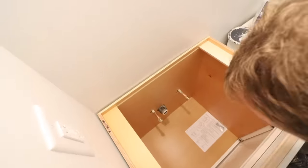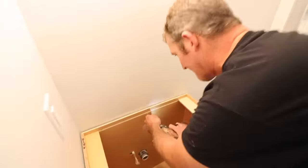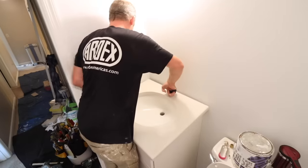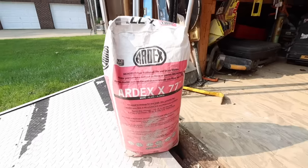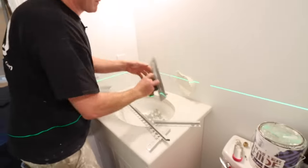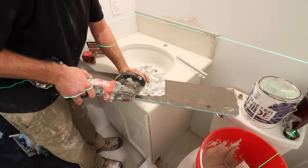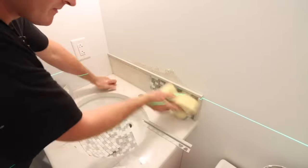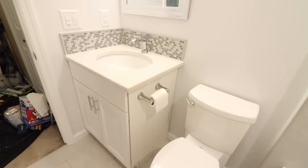Put your vanity in place, make sure it's level, and then find your studs in the wall with a stud finder — we use the Franklin stud finder, which has never let us down. Use two of the long screws that come with the vanity to secure it to the wall. Apply a thick bead of 100% silicone on the top perimeter of the base cabinet, then install the sink and clean off any excess silicone. We used a laser level to make sure our glass mosaics would remain level around the vanity top. We mixed up Ardex X77 — a thinset we use for mosaics — to the right consistency, cut down our Schluter Quadec, and used a 3/16 square notch trowel to apply thinset to the wall, added the Quadec, and used a diamond blade to cut through our glass mosaic for a square cut up against the Quadec. We then compressed that using our grout float and put a spacer between the bottom of the mosaics and the vanity top for expansion and contraction.